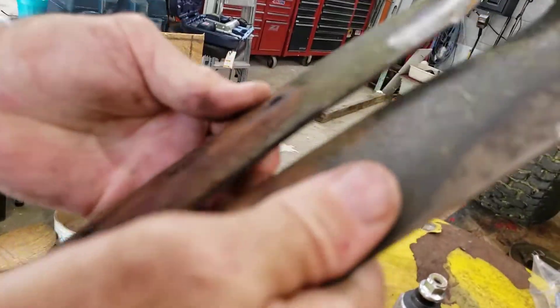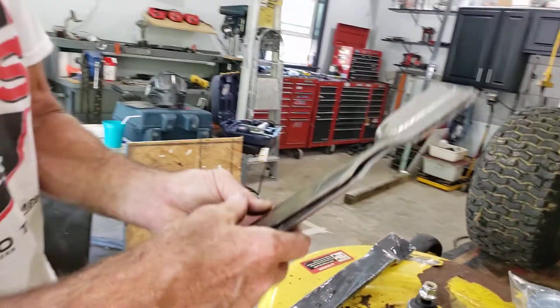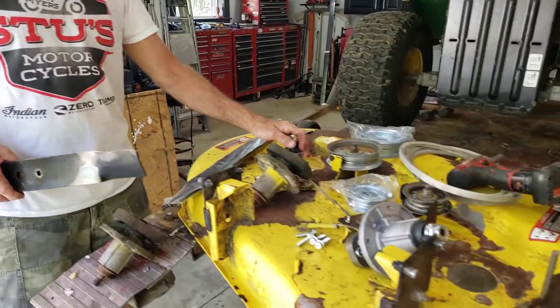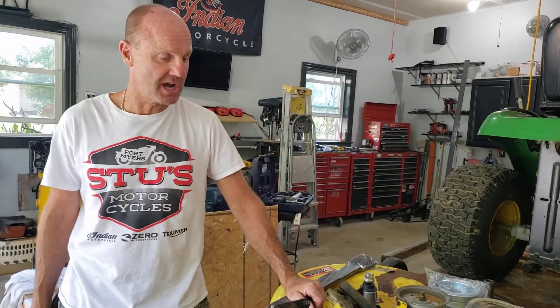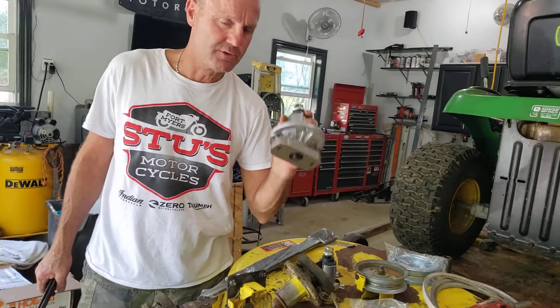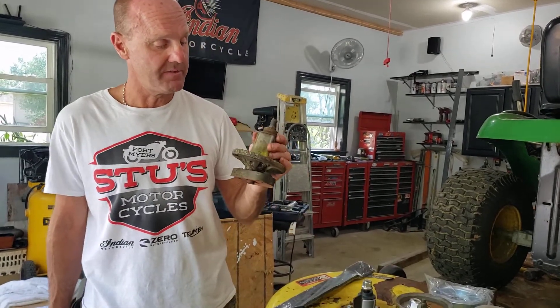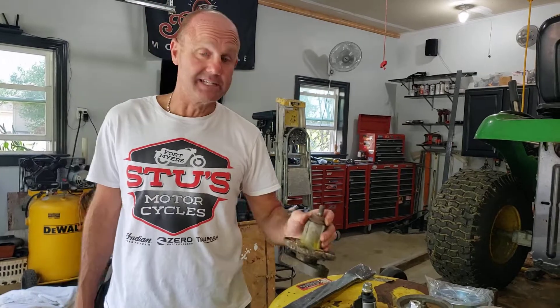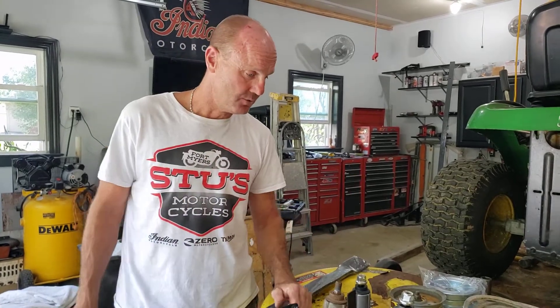So instead of just replacing one or two parts — which would be the blades, the belt, and one of the spindles — you just do it all. The entire kit is $106. It's very quick and easy to do, parts got here in three days. You'll probably save yourself a couple hundred bucks instead of taking it to John Deere. These new spindles have grease fittings, which you want to grease intermittently — the original ones do not, so that's probably why they gave out after years. But this is basically a deck tune-up. Save yourself a lot of time, money, and frustration with the belts and your blades — do a deck tune-up and that should do it for your tractor.